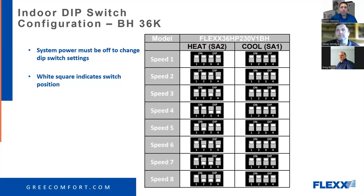Mike makes a good point — it's easier to think of Y as 'compressor' rather than 'cooling.' Y always triggers compressor in my head. Grant asks: does the heat pump start in heating immediately? Yes, it absolutely starts in heat immediately — unlike some inverter heat pumps that start in cooling and then energize the reversing valve once pressure gradient is achieved.